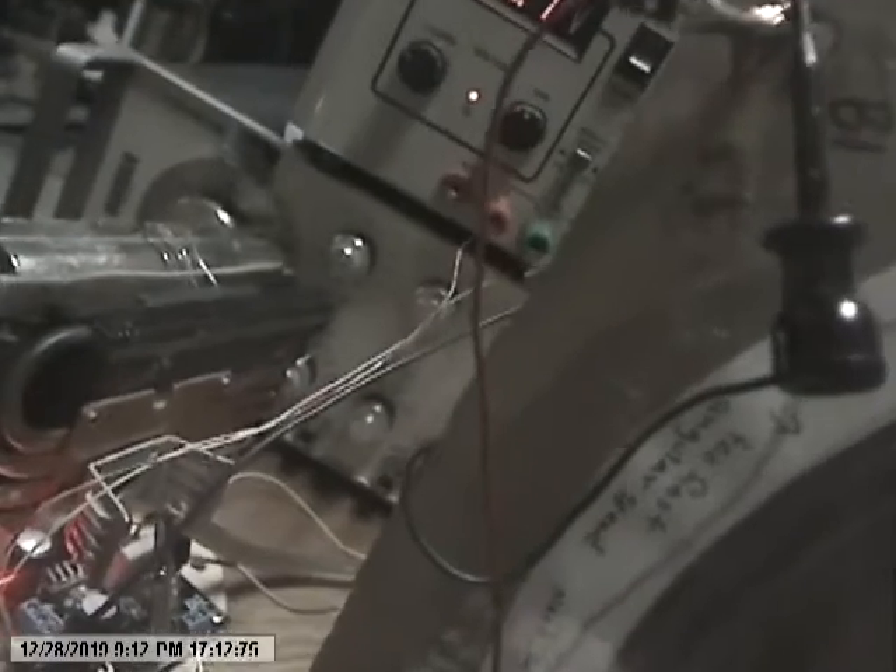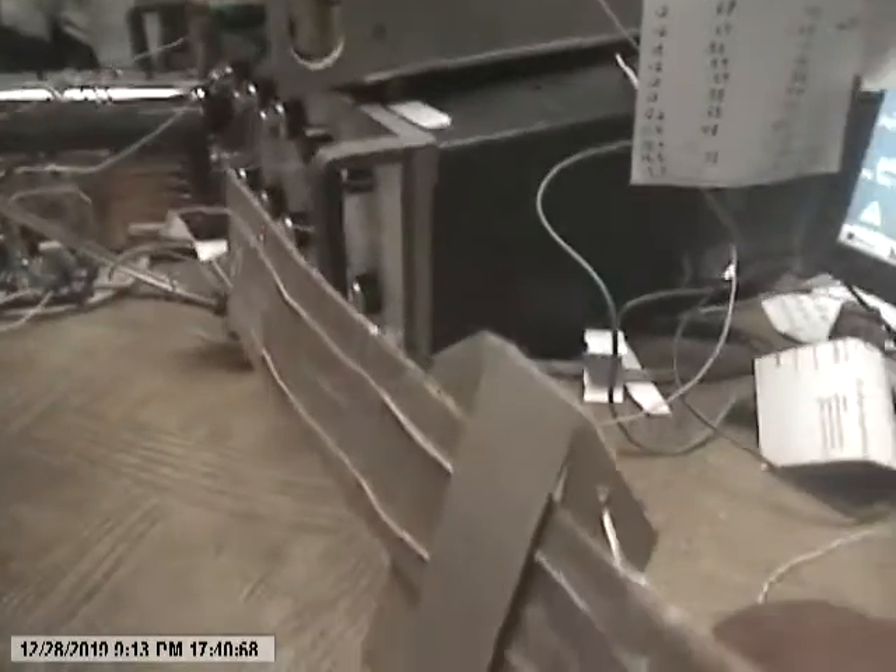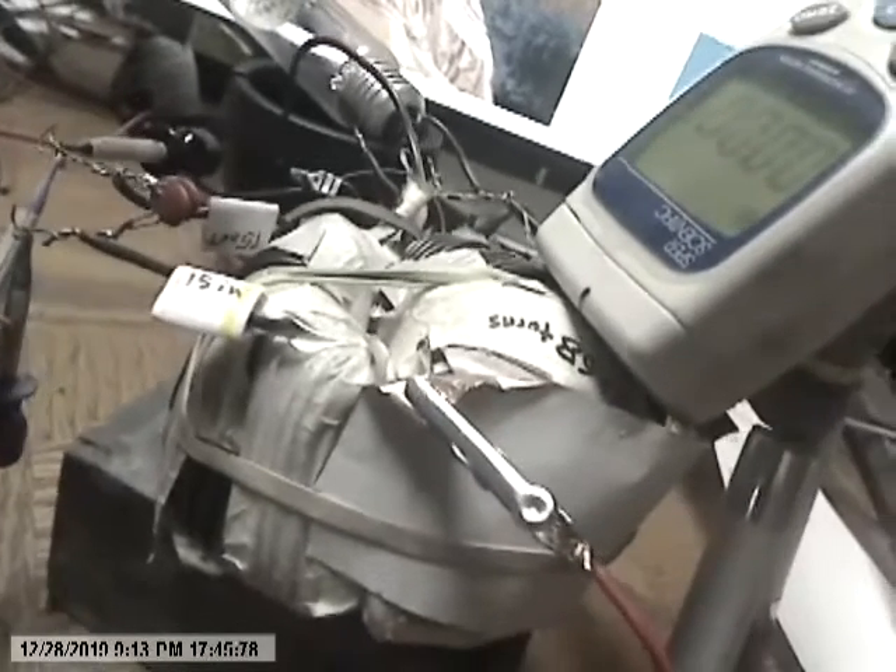I don't really need the big heat sink — I added that on for experimentation because this thing did run hot. I've got a fan on the back, and it's not really needed at these voltages and currents. My input has a dipole set up: one's the ground, one's the hot wire, coming off the amp and going into the core. It's the only ones resonating in this core.